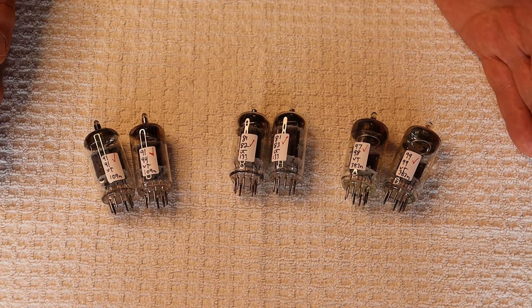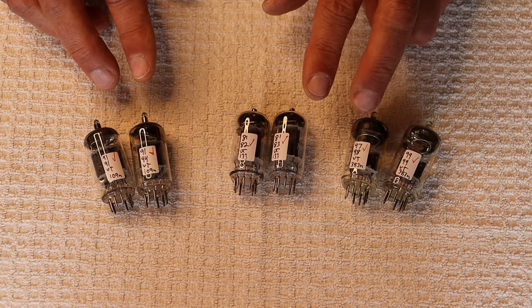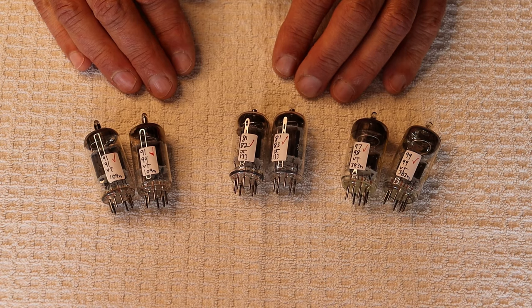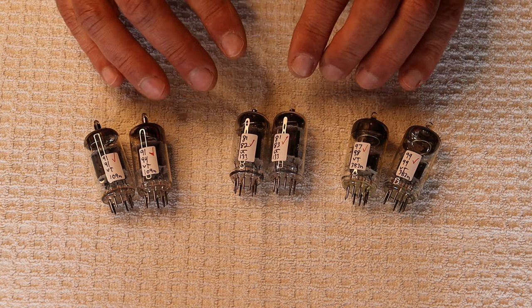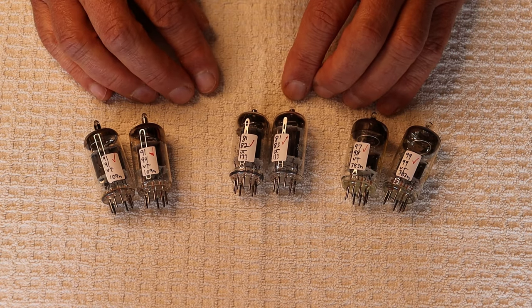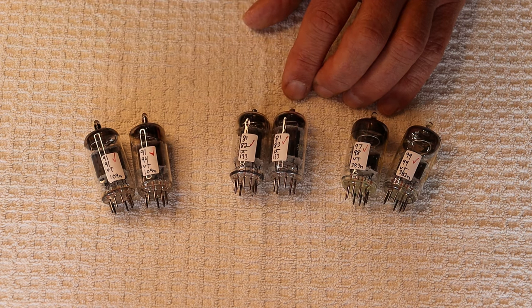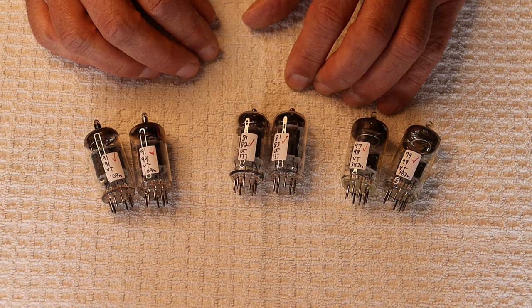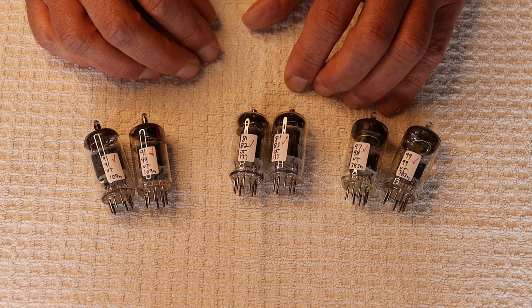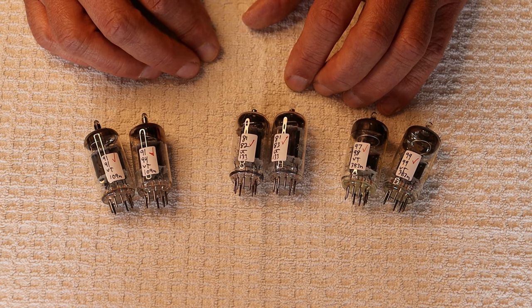So proper testing is really important. For high-demand tubes like the 12AX7, the very good vintage examples are almost non-existent now. There are a lot of sellers — not a few anymore — selling junk. Either they're used tubes that aren't testing well and are noisy, or they're new old stock that was never used for a good reason — passed over by technicians again and again because they just weren't testing well. And somebody with less experience or more nefarious intentions comes along and mislabels or misrepresents them, or doesn't bother testing them at all.